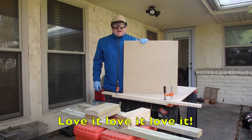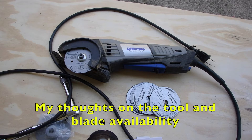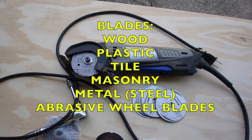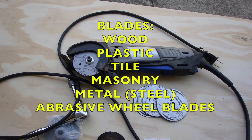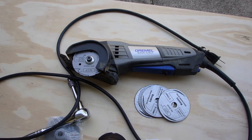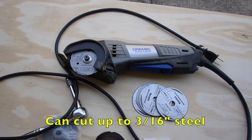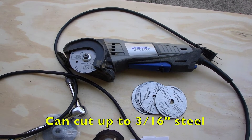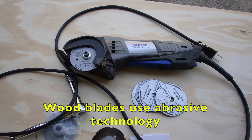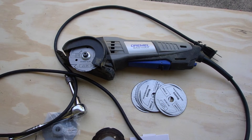That's awesome, I love that tool. This is a really great tool, super handy. I find a full-size circular saw to be very unwieldy. It's better for a fence if you have a full-size saw, but this can be used with a small fence and you can get a very straight cut. And if you have to make an uneven cut or a curvy cut, this is a really cool tool to have — especially if you're working on small pieces, trying to trim out larger shapes. Really handy, very quick, very safe.